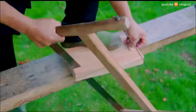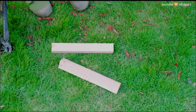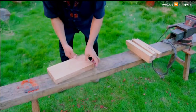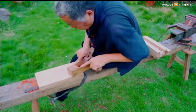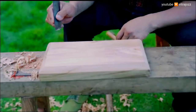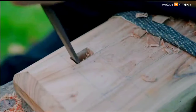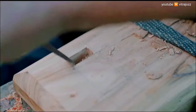How to build a wooden stool with a square top. To create the legs for the stool, first turn an 8-foot 2x4 into two 8-foot 2x2s. This is preferred over buying 2x2s because 2x2 lumber from the hardware store will have rounded edges, which isn't ideal for this application. To do this, rip 3/16ths of an inch from each of the smaller dimension sides to remove the rounded edges. Next, set the table saw's fence to one and a half inches and rip the board down the middle.